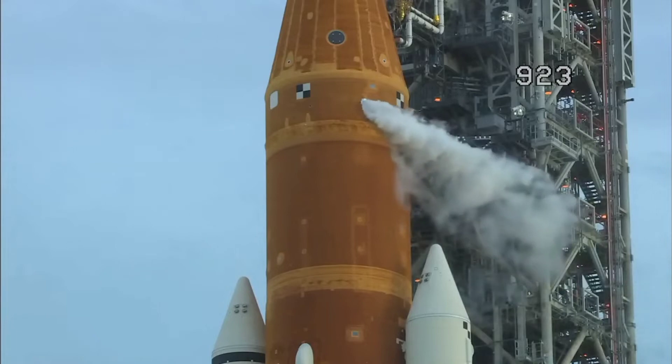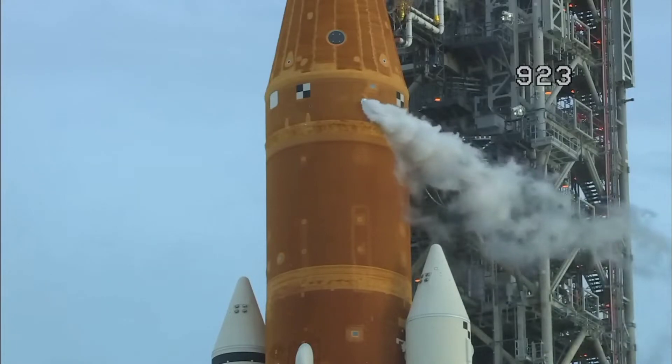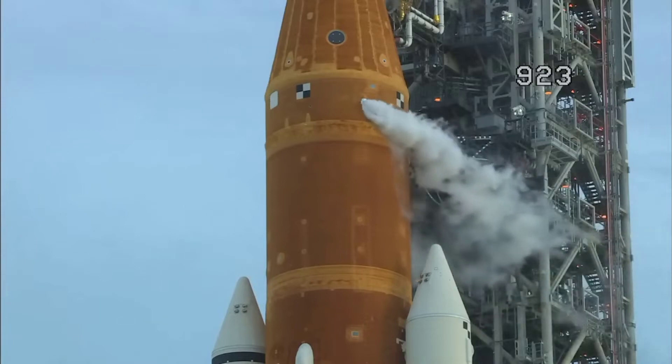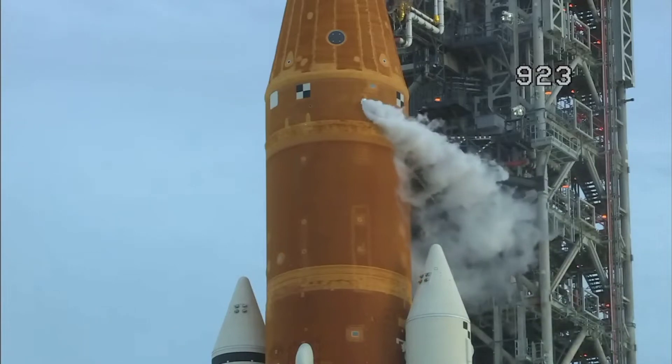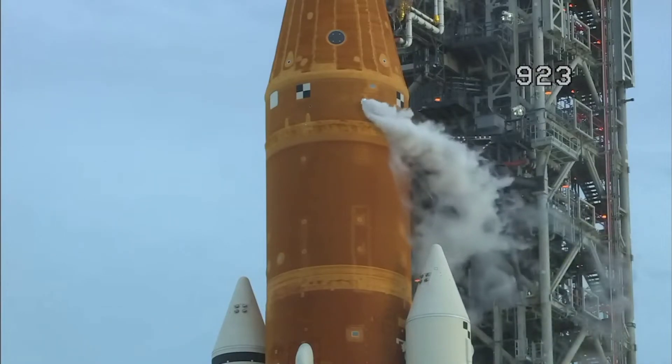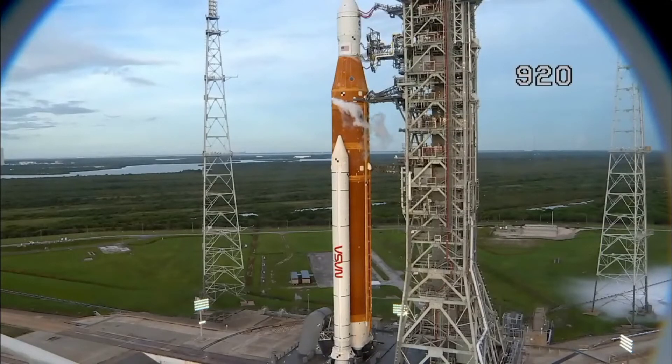In that area they've had trouble in the past — it's just a stress crack in the foam. They know this because they can see the offset: if it were a structural crack, one side would be coming out farther than the other, and they don't see that. So essentially, to the untrained eye it can look like a crack, but what it actually is, according to the engineers, is air being sucked in, chilled, and then coming right back out of that foam as vapor. It appears like something is leaking when in fact it's not, and they have a history of this going back to the Space Shuttle era, which had an external tank with super-chilled propellants in it.